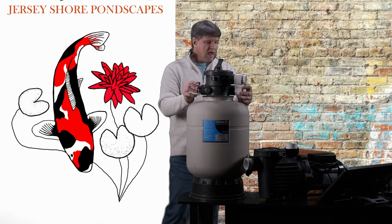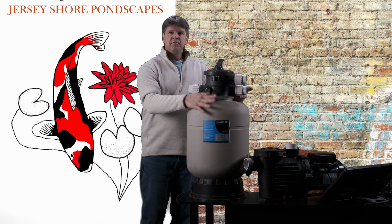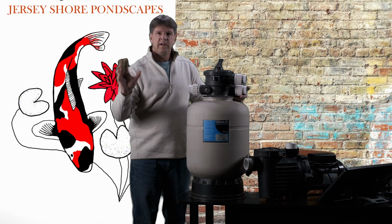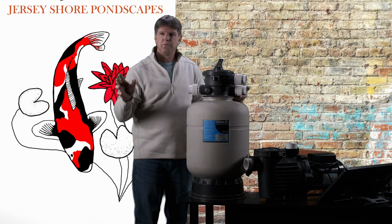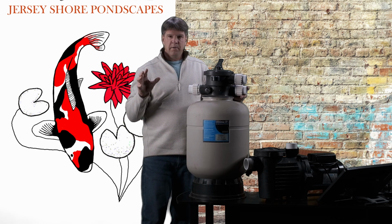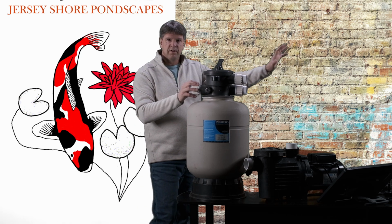So that's that. Now, one other little thing I'd like to talk about just briefly is I don't really use these filters all the time, okay? Only in some instances where ponds are already existing and I have to retrofit something, I can put these in. Or if somebody has an old one and something's not working or broken, and we need to update it, we'll put in a new one, okay? All my ponds, I use 4-inch bottom drains, and I gravity feed out into external filter tanks in the ground, okay?